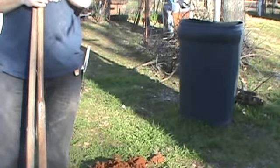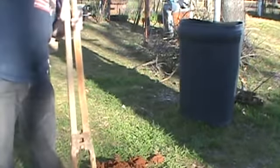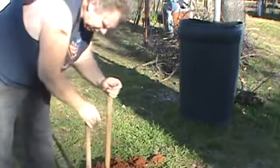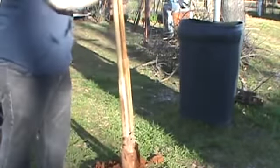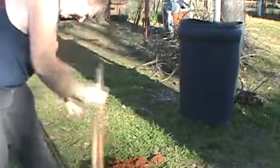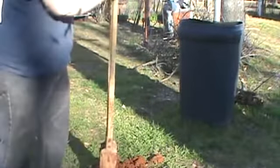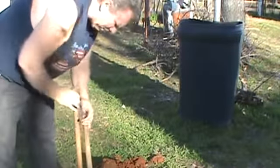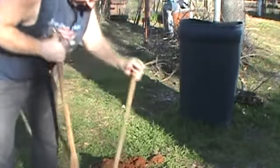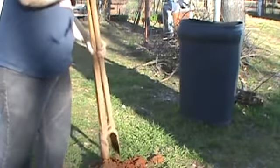What I want to do is get a 3-inch submersible pump down in this well when I'm finished, if I get plenty of water and good water. I don't know yet. We'll find out. Whoops. Did I flub up? I may have to widen it out anyhow when I get 5-inch PVC. I'm going to get about 10 foot of it, I guess. Probably go down, that's probably all the farther you're going to get with it.